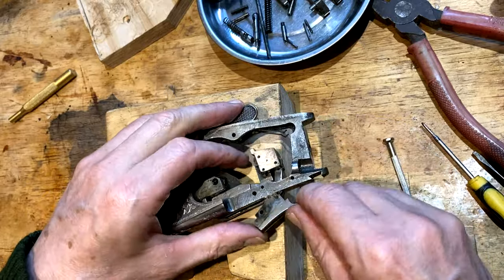Okay, so I've just soaked this in the ultrasonic and just want to run some acetone over it, as acetone will absorb moisture. It was hot, so it was obviously clean. It still pulls out a little bit of the old grease, which is good. Just to ensure that everything is truly clean.